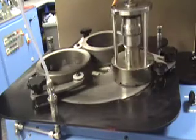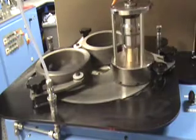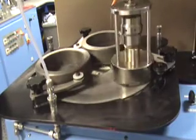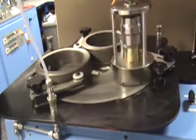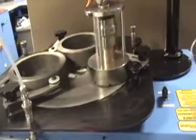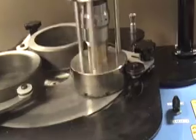The machine features three workstations. Each will take either a conditioning ring for maintaining plate flatness, or a vacuum jig for processing the thin sections. The vacuum jigs must be run in the larger black yoke rollers.